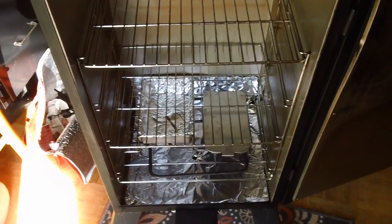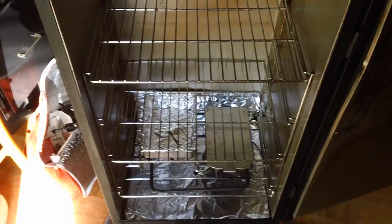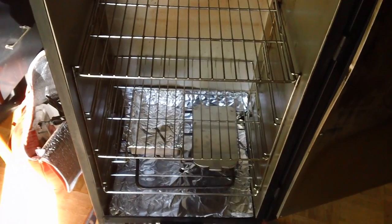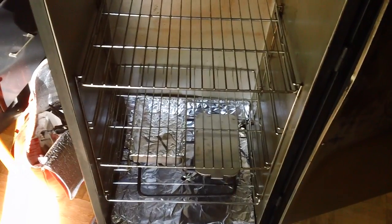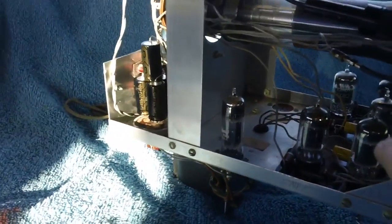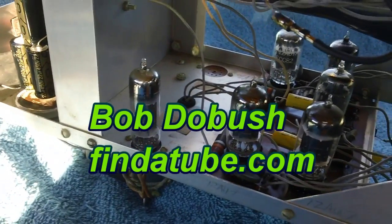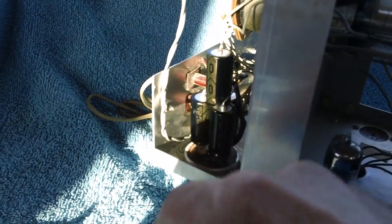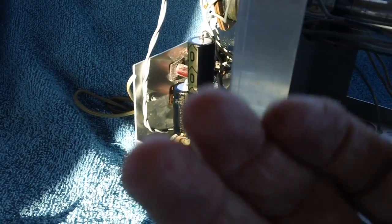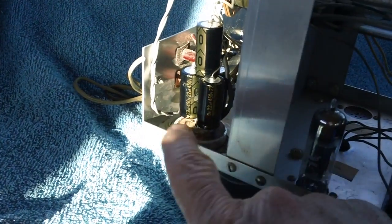Some people don't even bother cleaning out these smokers — they just keep cooking just the way they are. Not me, and I'll tell you why: I've had food poisoning, and the full week I spent in the hospital with it was not fun at all. So it's about as clean as she's going to get — we're all ready to go for Sunday. Now to wrap up with the old oscilloscope — I've done all the necessary work: replaced all the old capacitors with new film caps, changed out the electrolytics, and removed the can completely because I used larger voltage caps that wouldn't fit inside. I mounted them externally — they're sturdy enough. I might take a little toilet paper roll and stick it down over there and glue it in place.